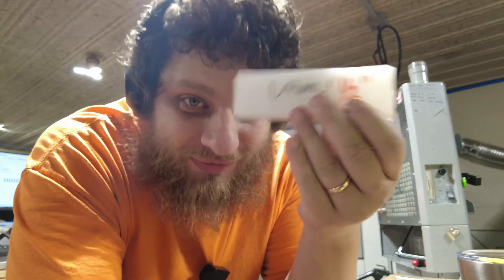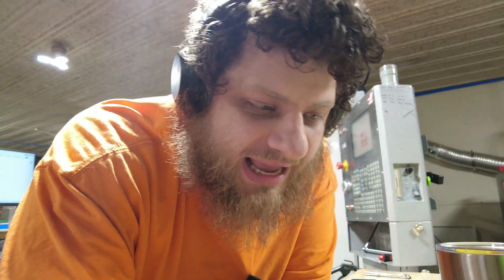Hopefully we can redeem this bar today, seven years later. Coming out of this bar should be 120 parts. The parts are these little cylinders — they kind of look like they have a Phillips head on the side of them, though it's not actually a Phillips head. We will be getting 36 of these parts off at a time. First operation is just to make a cylinder. Second operation we'll add the Phillips head thing. We'll do 36 at a time and then tab them off with a slitting saw — should be relatively time efficient.